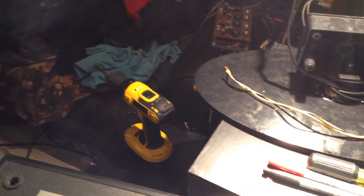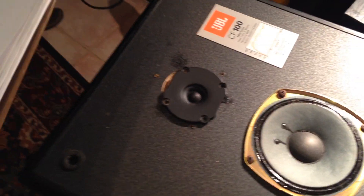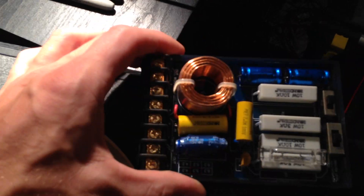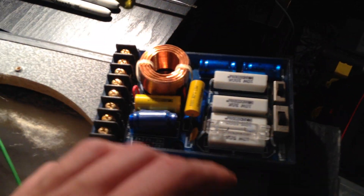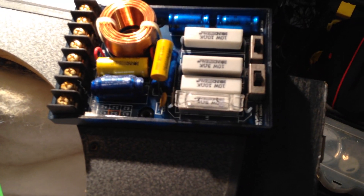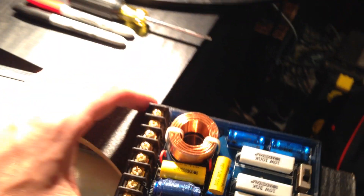He said one of the crossovers was bad. Well, of course he blew the tweeters, and I've got tweeters — these tweeters are awesome. I'm set up for it; I'm going to put a little adapter around there for them. But I've already done it on the other one. I'm working on this one. So what he had going on was he had the main AC signal coming in here, and he had it dubbed into this weird-looking crossover here with a Bose-style limiter.